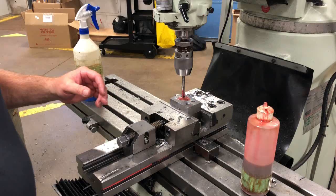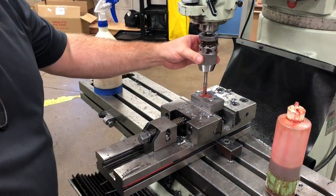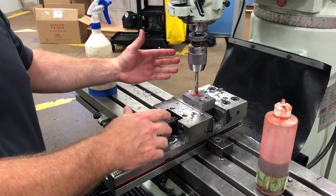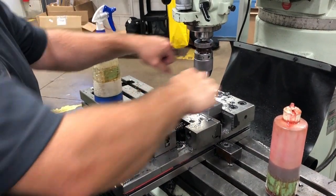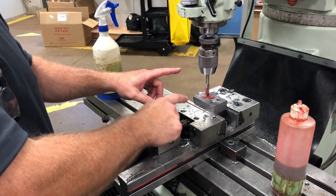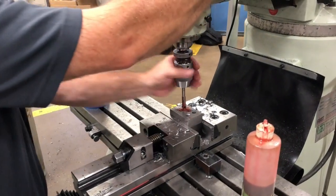So what happens when the tap spins in the chuck? What we have here is a chuck that's loosened. You don't want to put it super tight with a key chuck, but these non-key chucks — normally they're really good, but the ones we have are awful for tapping, though okay for drilling. So it came loose. Normally I would use a tap handle to break it free, but I want to start back in the exact same hole. So I'm going to go from the same start position and just power feed it down again. There's lots of oil on here so I'm not worried about breaking it.